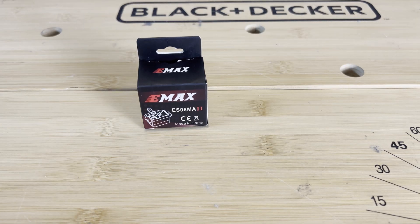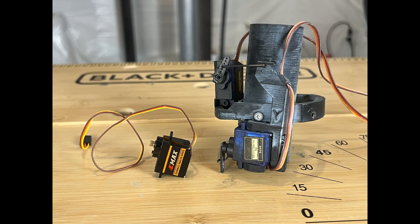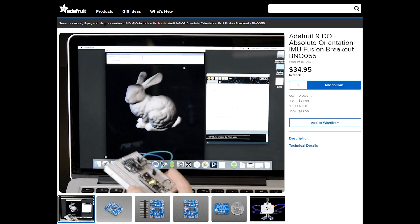I also slightly upgraded my gimbal — I swapped out those cheap Amazon plastic servos for something a little more robust with metal gearing. It definitely looked like it helped; every time I sent a command, that arm would actually stop where I wanted it to instead of bouncing. For flights one and two of Hussar, I upgraded the flight software. Instead of using accelerations to figure out where the rocket was feeling gravity and calculate orientation from that, I swapped to Quaternion — basically integrating your gyroscopes to get orientation, which is way more reliable than just using acceleration, especially for a moving body.